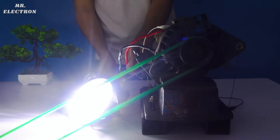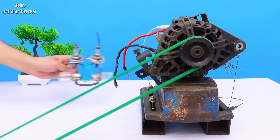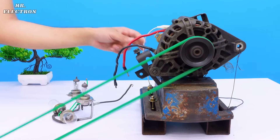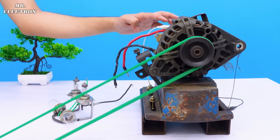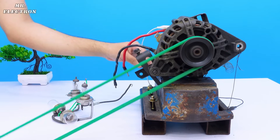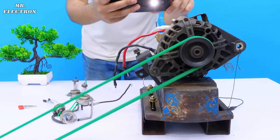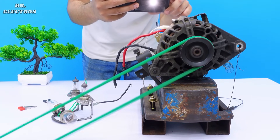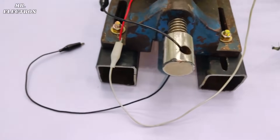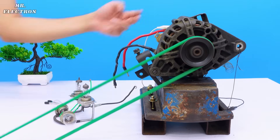Even a single Duracell is enough to excite a car alternator. Let's connect four car headlamps this time. The wire is smoking — too much current is being fed to the rotor and this jumper cable is not able to handle it. Let me show you things quickly before it goes bad. It's smoking. This is the jumper wire that is feeding electricity to the rotor through this red wire. Let's quickly connect this bulb setup before this wire burns out.